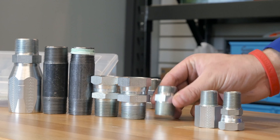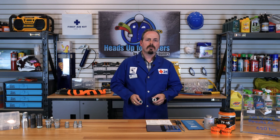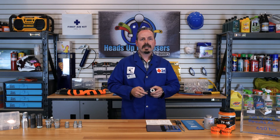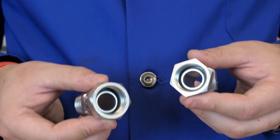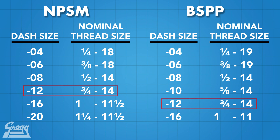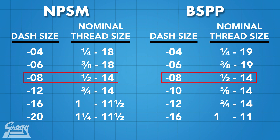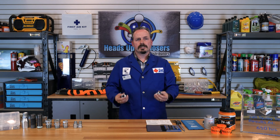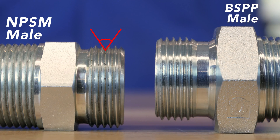A common problem when identifying NPSM fittings is their relation to BSPP or British Standard Pipe Parallel Threads. Although we have not touched on these fittings much yet, it is important to know their relation when attempting to identify NPSM fittings. Because BSPP fittings share a lot of the same design characteristics as NPSM, they can often be mistaken for each other and at certain sizes even thread together fairly well. Referring to these size charts, we can see that when dealing with dash 8 or dash 12 fittings, these two share the same nominal pipe size and thread pitch, making identifying them very difficult. The biggest difference is that pipe thread has a 60-degree thread angle, whereas BSPP has a 55-degree thread angle. This means that even though they feel like they thread together well, the difference in thread angle means a true seal is never formed and there is a chance of leaking.